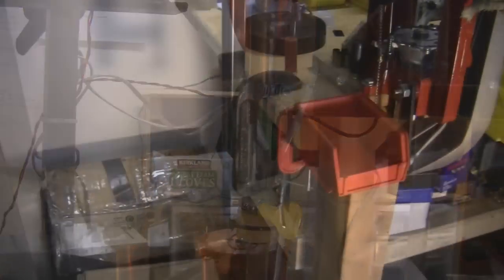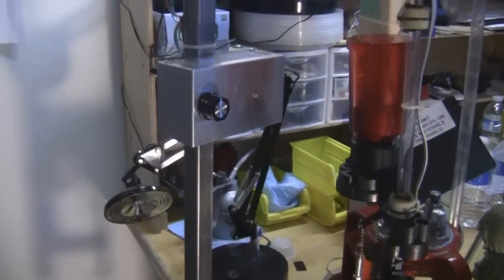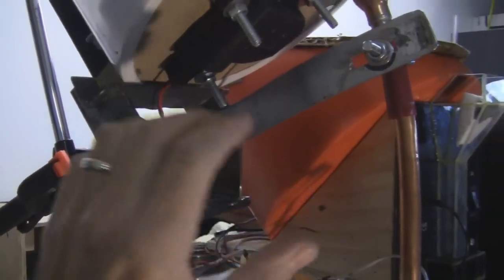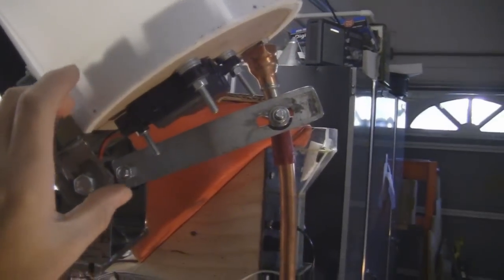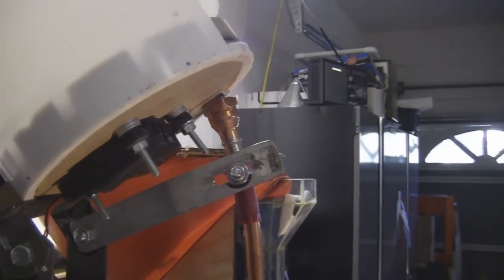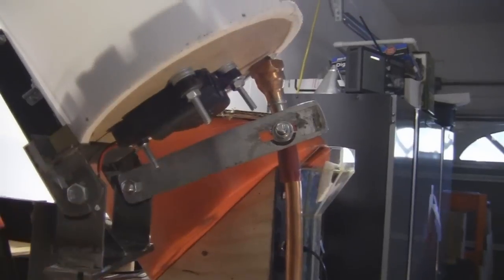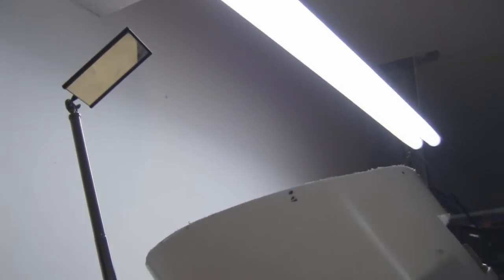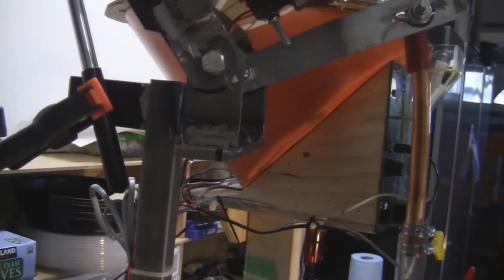The stand is just a piece of tubing that I welded a C-clamp onto, so it can be mounted to the table. I designed the mount so I could loosen the bolts and tip the angle of the bucket. The bucket sits at about a 30-degree angle rather than 45 degrees, and I wanted to be able to adjust the tilt because if the bullets weren't properly tipping over when they come out the mouth, I could tweak that angle to make it work better. There is a lip back here, and I have a mirror mounted up there so when I look up I can see if the collator is empty.